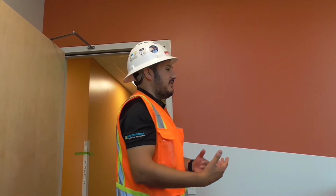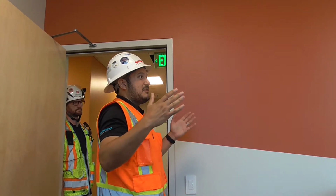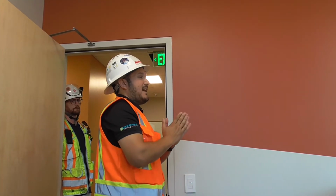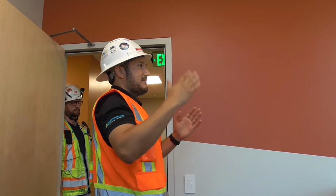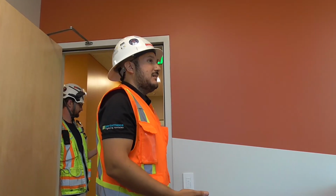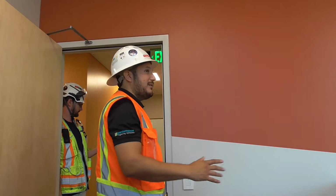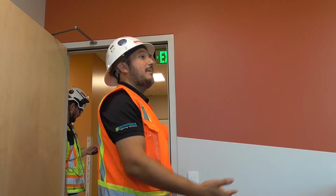The way it works is if I leave this room right now, I hit the switch off, and we leave it, that 20-minute timer to turn the lights off, that same timer, when it expires and the room is vacant and the lights are off, it puts the room back into auto on position. Meaning, if I hit the switch off, we leave, and we come back 30 minutes later, these sensors will automatically tell the lights to come back on.